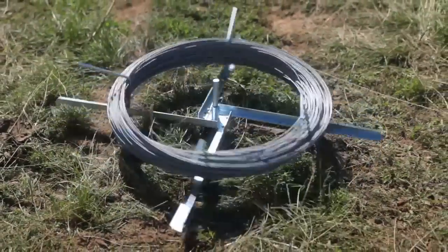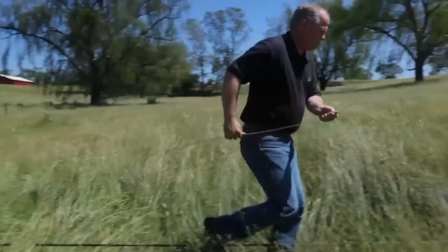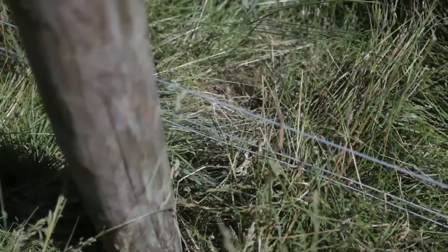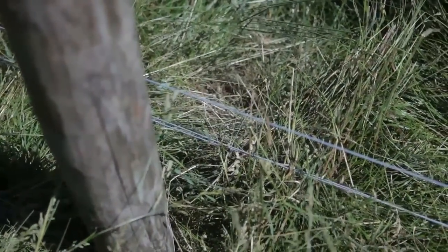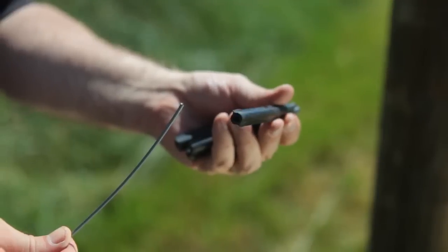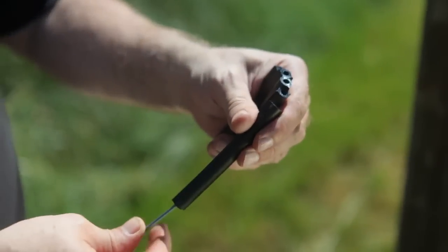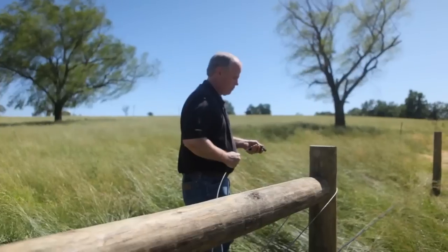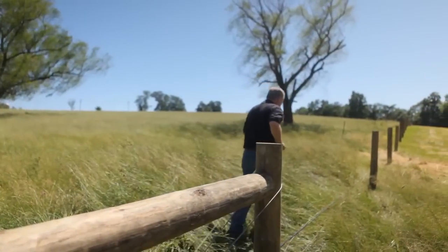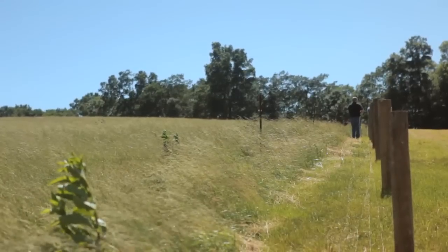Now you're ready to pay out the fence wire using the spinning jenny. Generally place wire on the side of the post that will have animal pressure. This means the post will resist the animal's pressure at the connection rather than at the staple. Before stringing wire, determine which wires will be electrified, so if needed, thin tube insulators can be placed on the wire as it is strung. To avoid wire tangling, string one strand of wire around the enclosure and attach it to the posts before stringing the next.